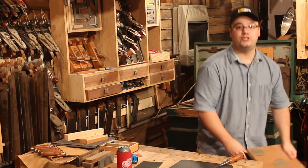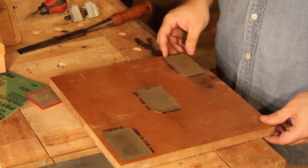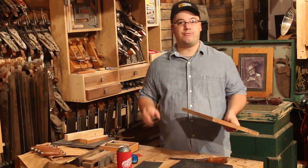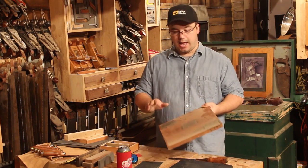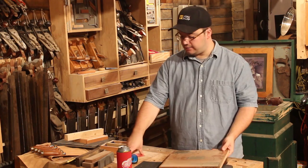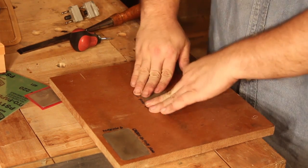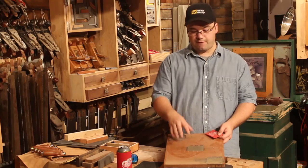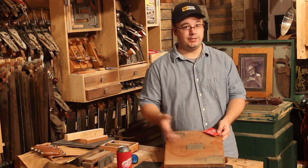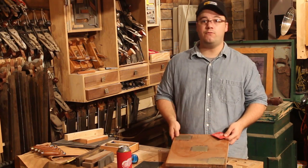What I did is I took a thick piece of MDF. I think an acrylic material would be even better, like one of those trivets or a cutting board or maybe a thick piece of PVC. And I used my router, set to the depth of the thickness of that little diamond plate, and I embedded them in the top of this surface. Of course, this MDF is going to swell up from water, so I had to put like a billion coats of poly on this. That's why I think the acrylic could be better. But it did work out for me.